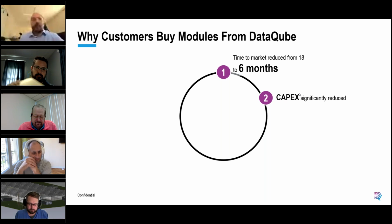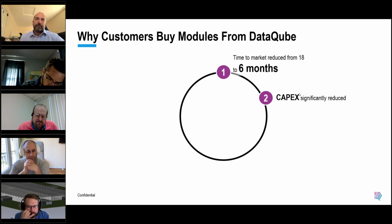So, for example, if you're adopting new kit from AMD and Intel, you're going to want a solution that accommodates perhaps a kilowatt a U, and therefore you're going to need 20, 30, 40 kilowatts of cooling per rack. Now, traditional colos that are still being built in the 5 to 7 range are going to struggle to meet such requirements.